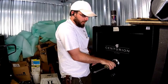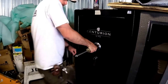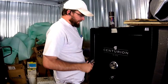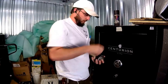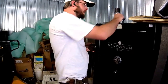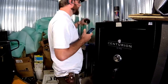Of course, now that I say that, it probably won't happen. But the less times we actually beat on this, the better. The quicker it comes off and the less shock we provide to it is going to be the better option. So hopefully we can get it off in one hit. You can see that big shock. Now, if you have glass or even just the standard re-lockers in here, and they're hanging on by a thread — because maybe the safe was attacked or fell or something happened — you could still set that off generating that much force. So we're actually going to try the other one here. You can see it's a fairly violent action.